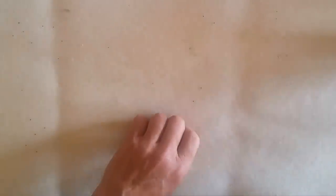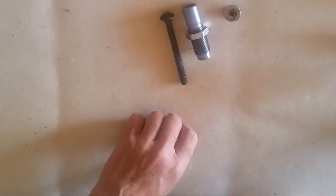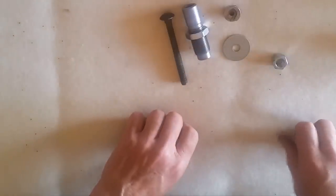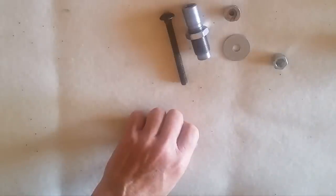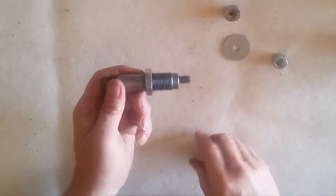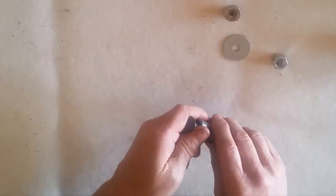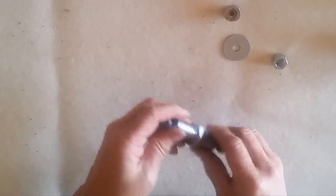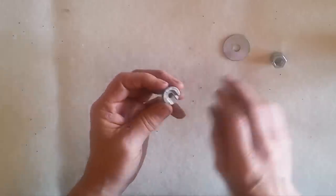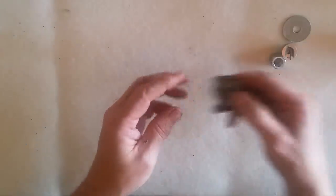So I got to thinking: what can I do with an odd die, a shell holder, a washer, a few other parts to make some kind of an adapter? Well, that could be a regular C-press and end up being a plunger part of a ball seating ram. A shell holder welded onto a slug of metal with a washer offset — it could turn out to be something that looks like this, ugly as it is.